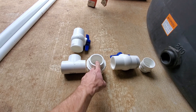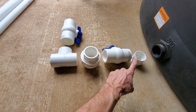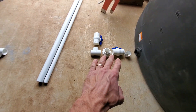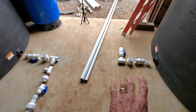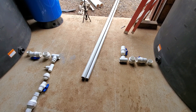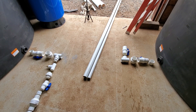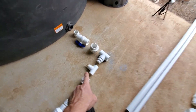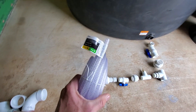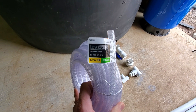I've got another coupling — a screw-on coupling — I can disconnect, and then a shut-off valve and fitting. So all that connected, the line going from one tank to the other is going to act as the transfer tube so that the water in each tank stays the same level. And this tube fitting here — I'm going to put on this braided line; you can see it's got a 250 psi rating on it.